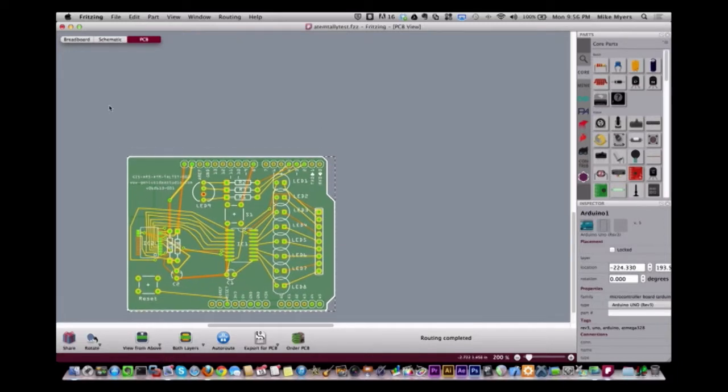All right. I didn't run into that problem, but I know that when I was using the auto router on this last board, I've got dozens of trace lines running on the top and the bottom, and I just had too many lines. So on that one, I would find a few lines that I liked that were in the right place, and then I would lock them in place and leave them and then run the auto router again. Right, and that's what I was doing too. But there came a point when the auto router wouldn't do any good.